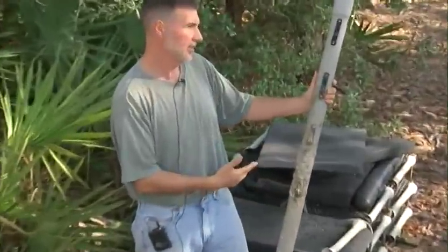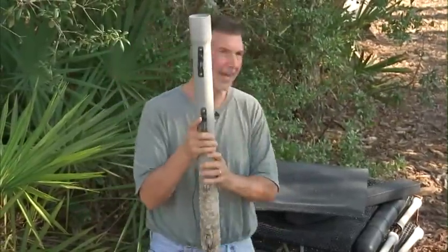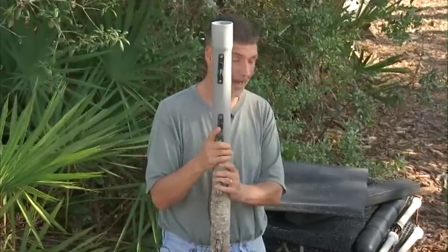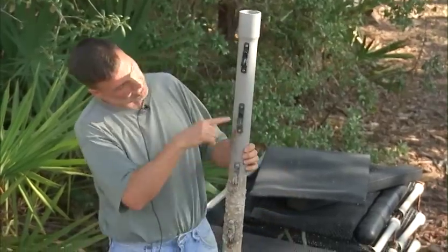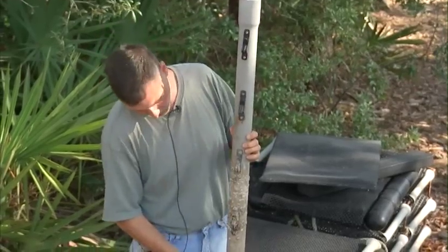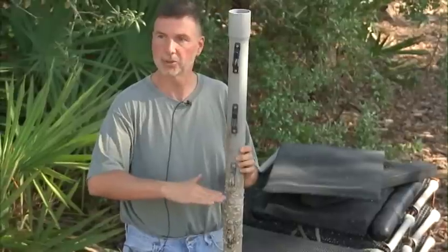It's UV resistant. It gives us a sturdier pole. And you could jet these in, but our bottom would be too soft for that, so we pound these in. You pound this in so that the middle clip, I'm supposed to have 5 clips here. 1, 2, 3, 4. There's a clip here. This clip would be where that line wants to rest naturally.